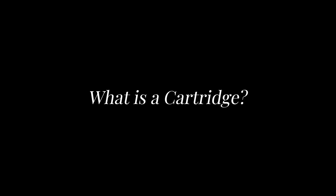How did they start, and what are they? What is a cartridge? The very earliest phonographs used what's called a reproducer. It's completely mechanical and amplifies the sound using a mica diaphragm. In order to amplify sound electronically, we need to convert the mechanical information contained in the record into electrical impulses. It's the cartridge's job to do that — converting the mechanical energy in the record groove into electrical energy that can be amplified and then converted back into mechanical energy in the loudspeakers.